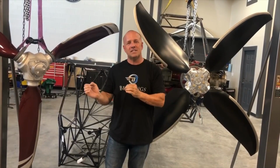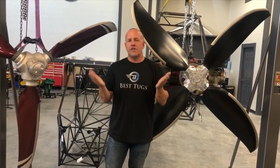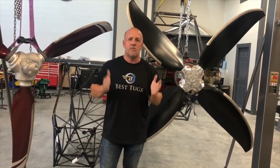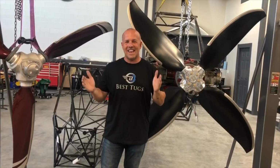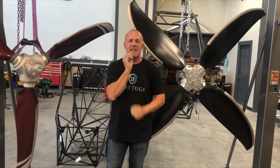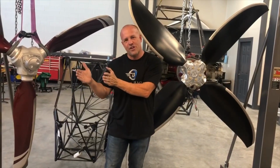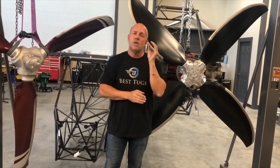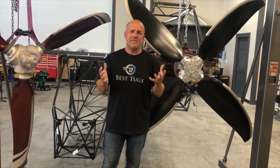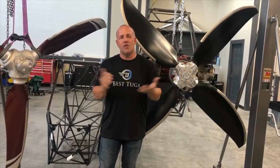So, if I'm flying with my friends and they're out burning 10 gallons an hour, they're pushing roughly 13 horsepower for every gallon per hour of fuel flow. So if they're burning 10 gallons an hour, they're flying their Carbon Cub at roughly a 130 horsepower setting. If I take this plane and put it to 130 horsepower, all 8 of my cylinders are consuming half the fuel per cylinder, but more cylinders, equaling the same 130 horsepower on 10 gallons an hour, with the exception of the rotational mass. So I am going to take a fuel penalty of an extra 5 to 10% on the high side. I'm going to burn another gallon an hour at a given airspeed. So I'm willing to sacrifice that little bit.